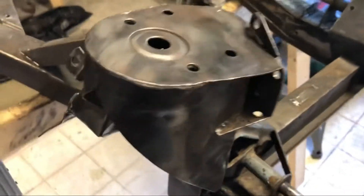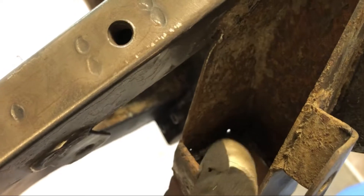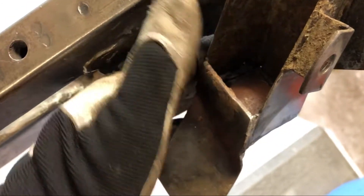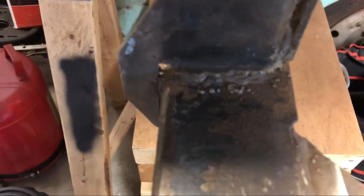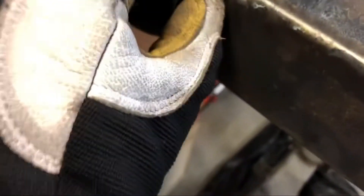Now that I got a flip back over, it's all looking pretty good — pretty clean. Got a couple little pinholes you can see down here where I did my repair. I think I can just clean up that backside a little bit, fill it with a little weld — put some copper on the outside and try to hit it from the back to fill those little holes. All the rest of the welds look pretty good, including the rear where the shocks are. They pulled away a little bit but they're still very, very solid. I might go back and add a little bead right in there.